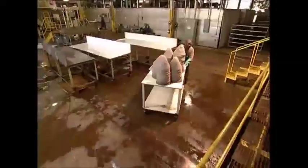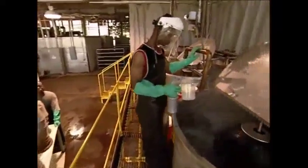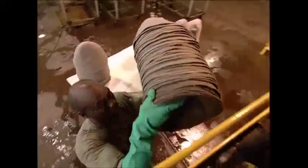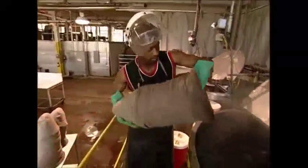At this stage, the hat looks more like something a farmer might wear, but this will be a cowboy hat soon — it just needs a bit more work. Before they start being properly shaped, they need to be dyed. Two and a half hours at 80 degrees Celsius will give these hats a rich dark brown color.